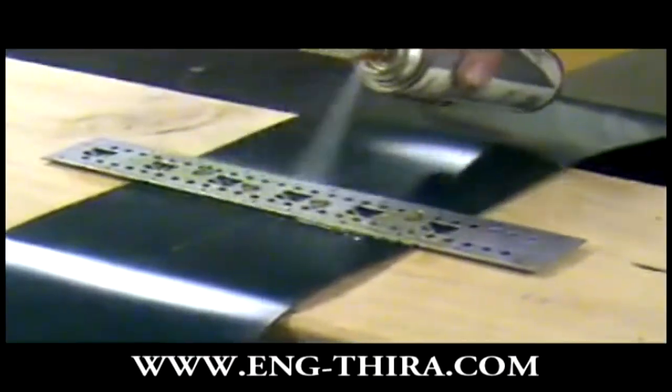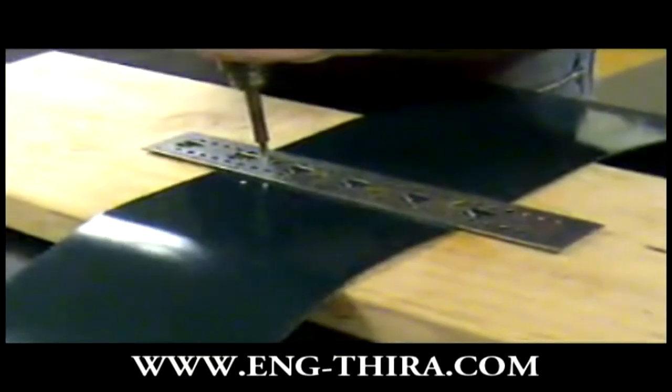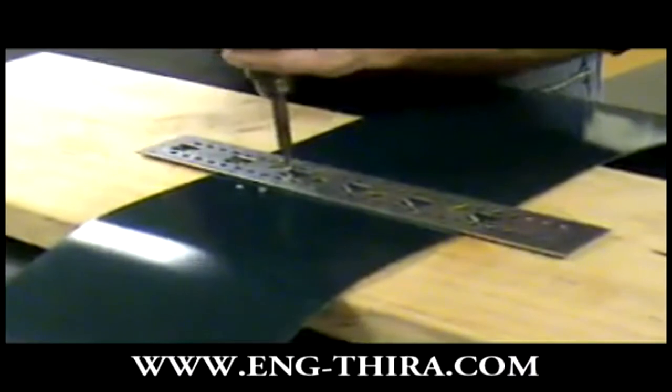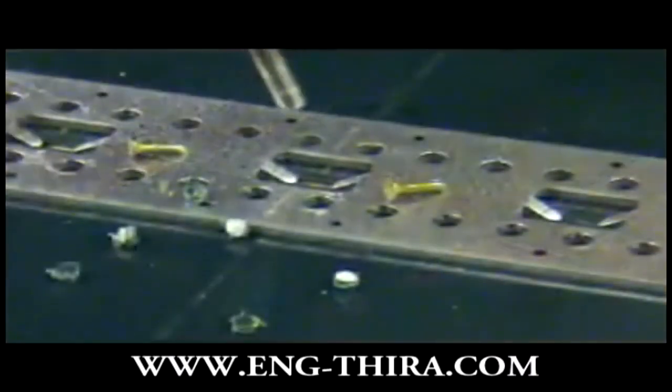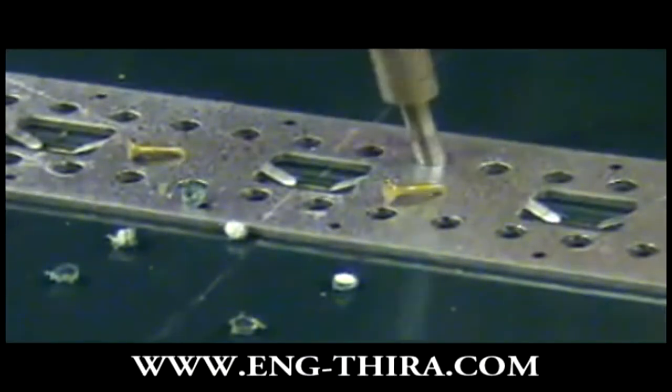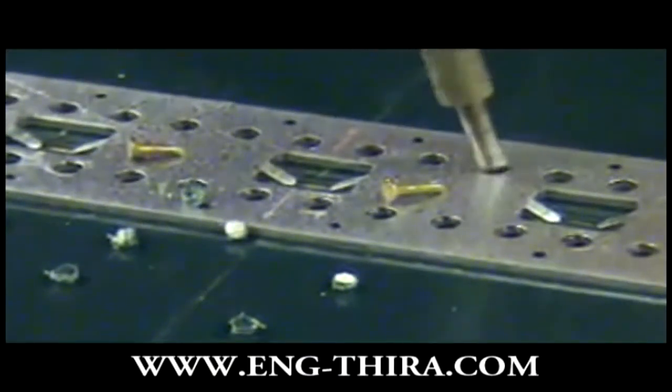Using a 3/8 inch drill and the proper APF punch, spray the alligator plastic rivet lube into the holes of the template and drill the holes through the belt. Be sure not to drill the holes up to the edge of the belt — leave 1/4 inch of the belt at each edge open for notching.